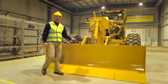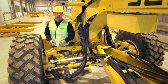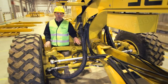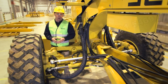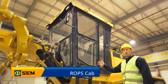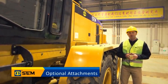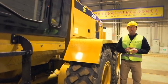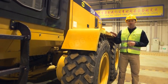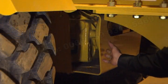The SEM 922 offers an exclusive all-wheel drive system, with two independent left and right pumps driving hydraulic flow through the front motor, providing exceptional traction and performance in wet underfoot conditions or during snow removal. A ROPS cab is available for additional rollover protection or to meet regional requirements. Factory options include fenders, radial tires, an underneath cab guard, and a transmission guard.